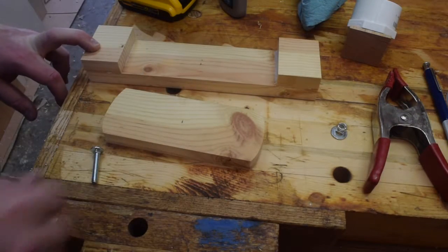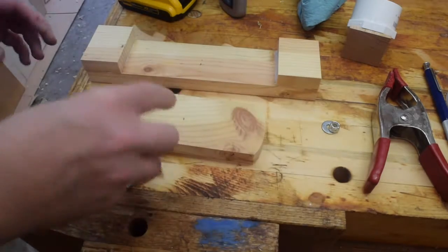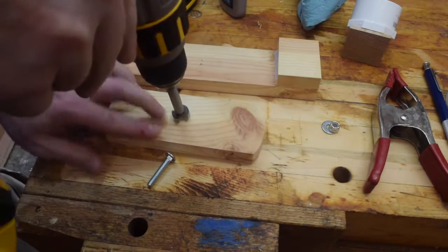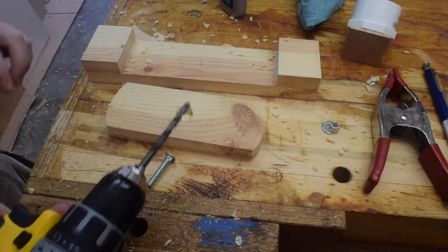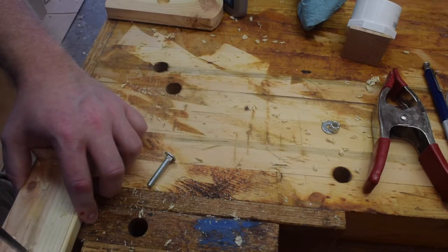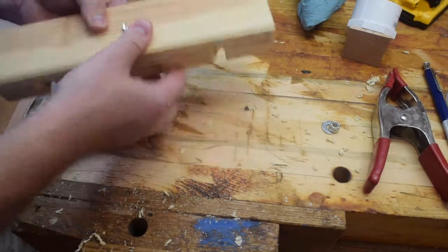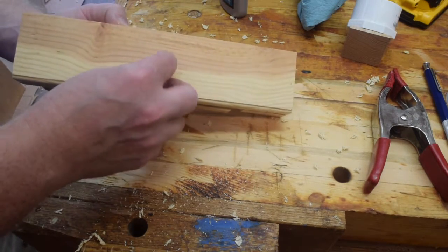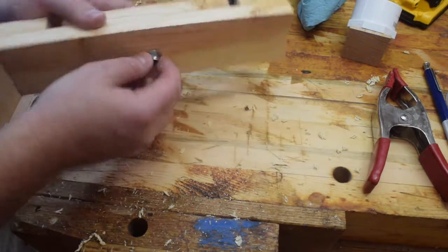Clamped for about 10 minutes, we're going to move on and see if they break off or not. The plan is to use a quarter-20 bolt and stop nut to act as a pivot between the two. The first thing we need to do is drill a relief with a Forstner bit on the bottom so that the bolt head is below the surface, then come back on both pieces with a bit that's a little bigger than the quarter-20 to allow the bolt through. I'll probably need to knock that in a little deeper just to get enough thread engagement for the locking nylon.